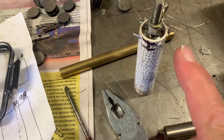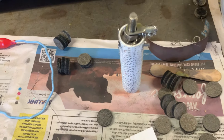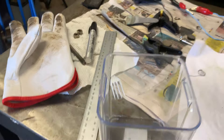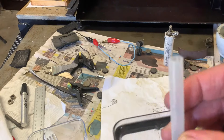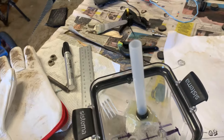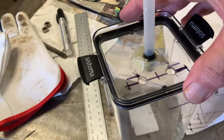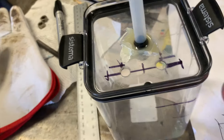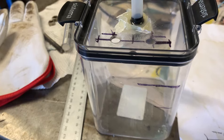The iron cell has 20 layers; the nickel one has 14 layers of felt pads. The electrolyte level will be about 5mm under the little breathing spout and fill hole — long enough so nothing can come out. I've had potassium hydroxide at 8 mole in one of these before, so it works and holds good, with nice staining of the sides.